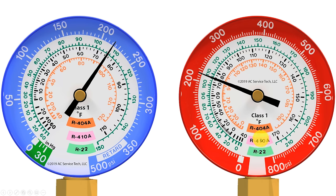In this case we have R22, R410A, and R404A. The gauges are reading 217 PSIG. Here we're reading the saturated temperature of R22 at any given pressure. For R410A — the color is pink or light rose, indicated by this black line — you take your pressure and bring it into the inner ring for R410A if you're measuring an R410A system or bottle. And here you see R404A — you just bring your pressure to the inner ring.